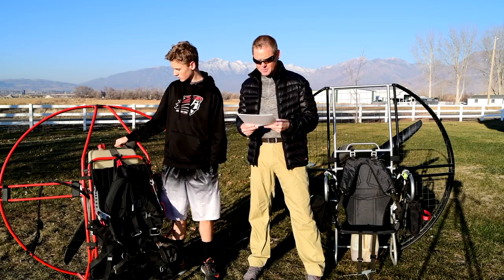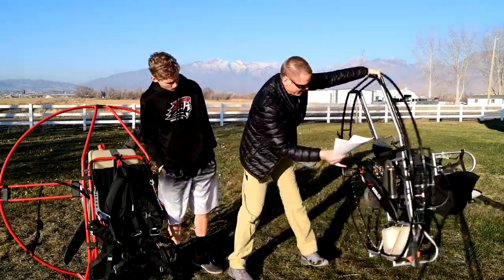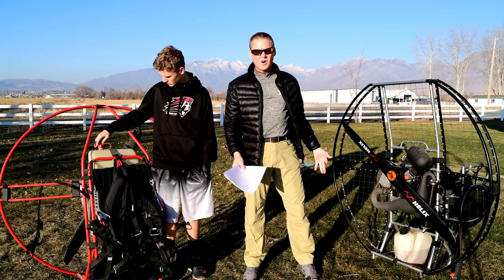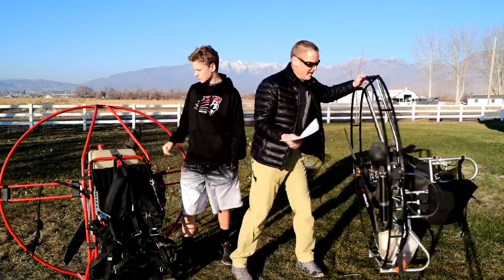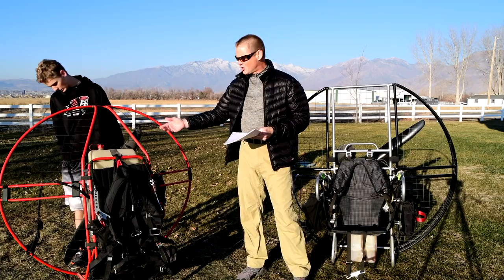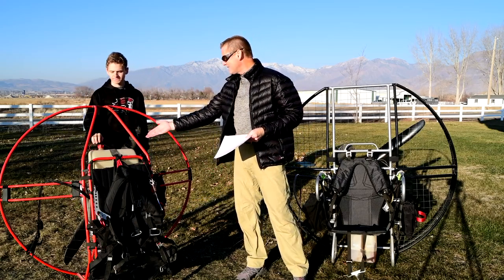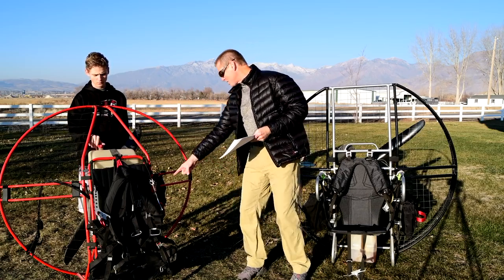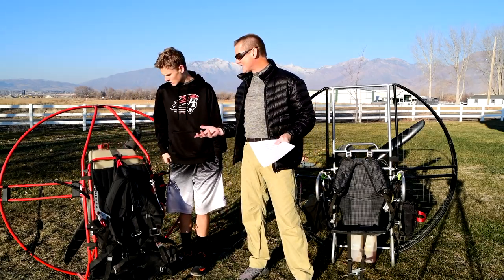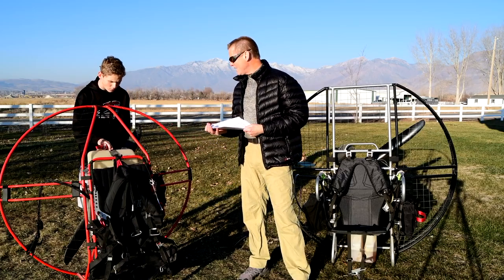Gas tank mounted with fill cap to the rear for easy fueling. On the flat top, it's very simple to refuel because the gas cap is on the back — you just gas it up from the back. If you spill gas, it falls onto the ground or away from the paramotor. That's another big issue with a lot of other units like the fresh breeze — if you spill any gas, even a drip, it's going to drip down onto your engine and all over your harness. Some units have the cap on the side and it's really tricky to get to. If you accidentally overfill it, all that gas dumps right onto your engine, which could be a very bad plan.